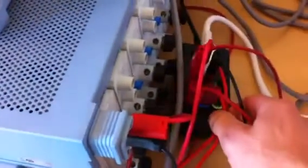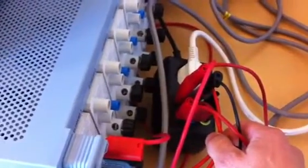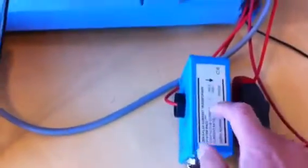We're measuring the current consumption of both these instruments. So the same current is fed through the power meter as a reference, and we're also measuring with the clamp and with this high-tech current sensor. This sensor is rated up to 500 amps, and at the moment we're only measuring 600 milliamps, so we'll also show that it's accurate all the way down to smaller currents.